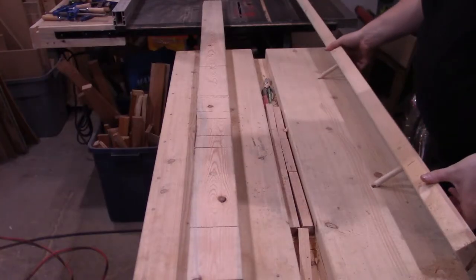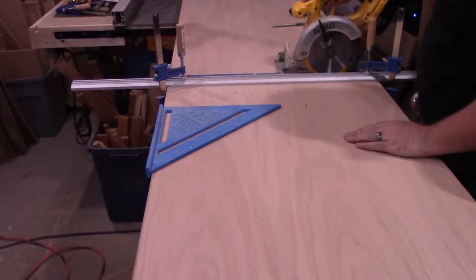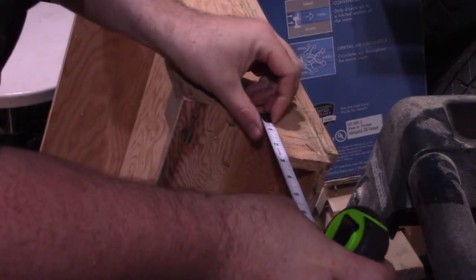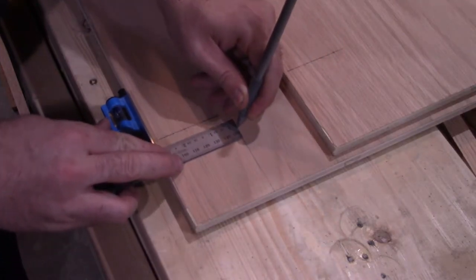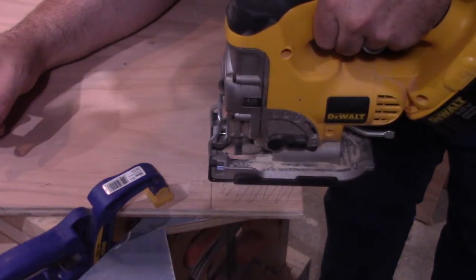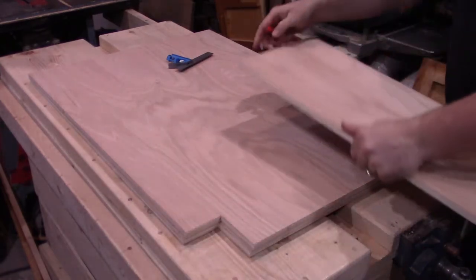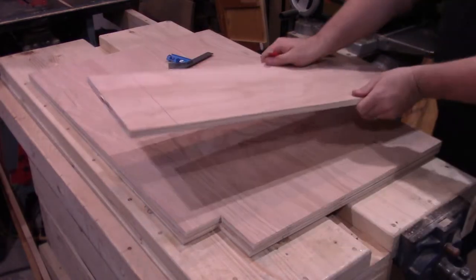With the crosscut supports up on the workbench, I taped the cut line with some painter's tape to prevent chipping the veneer, set up a straight edge, and cut the plywood to length. With the pieces now a more manageable size, I cut them to final width at the table saw. To cut out the toe kick on the new cabinet, I referenced the still intact old cabinet base to get the dimensions, mirrored them over to the new plywood, and cut out the corner with the jigsaw. To keep the jigsaw from blowing out the veneer on the inside of the cabinet, I clamped a scrap piece of plywood to the back side and cut through it as well. Since I already had some scrap left over, this piece was already the perfect width for the bottom panel, so I marked out the length and cut it at the miter saw.